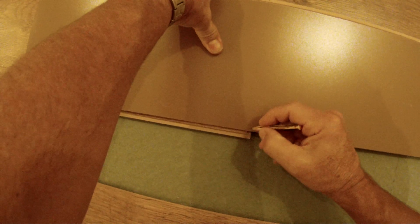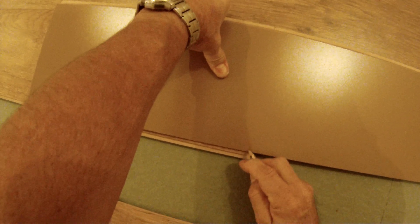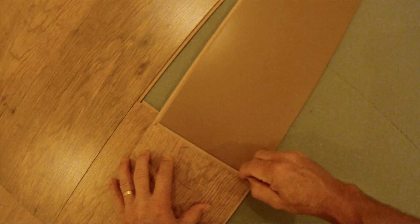Certainly the other end of this particular room is rather more bent, so you have different dimensions on this side of the board compared to the other side. You want to mark it where the board is stopping — that's where we're going to cut it. Just need to get a straight edge to mark that cross. Once I've cut this, we can get all the boards in position and then I'll go along and tap each board over and they'll all slot in and go flat. The off-cut we could then use for the next row.